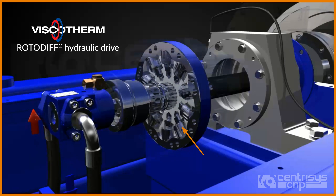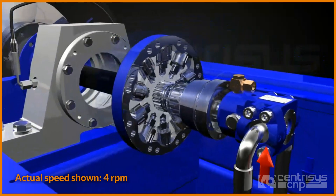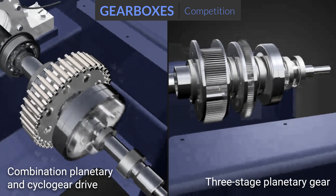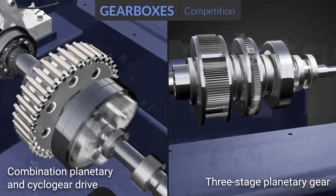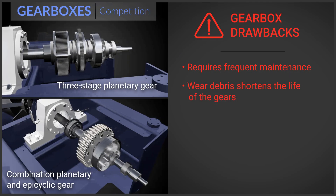The hydraulic internals shown here move at about 4 rpm at actual operating speed. Most gearboxes use a brake, dual pulley, or torque arm setup which draws power from the main motor to drive the scroll, requiring the main drive to be oversized. This is akin to driving a car with the parking brake on — the main motor needs to be sized larger as the gearbox destroys the energy provided by the main drive in order to power itself.